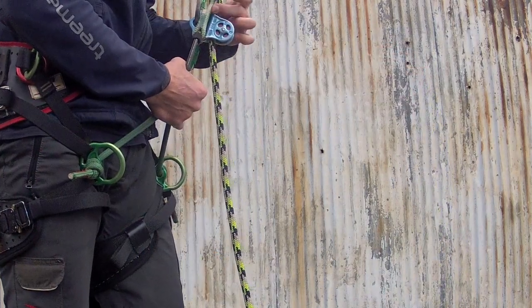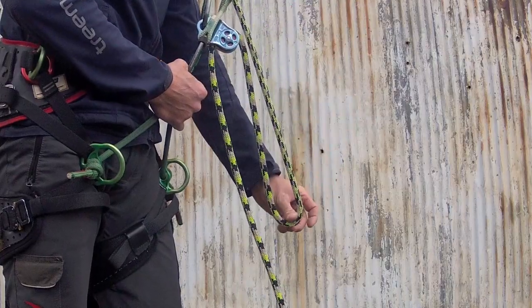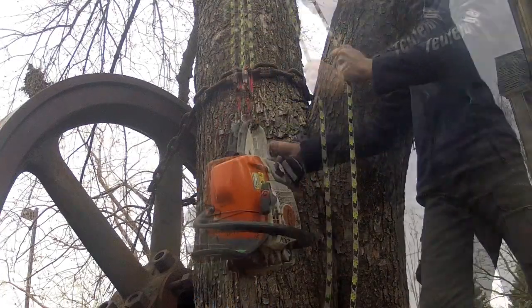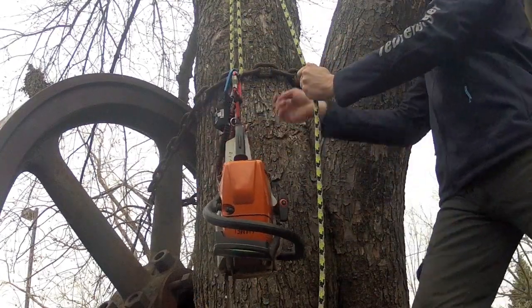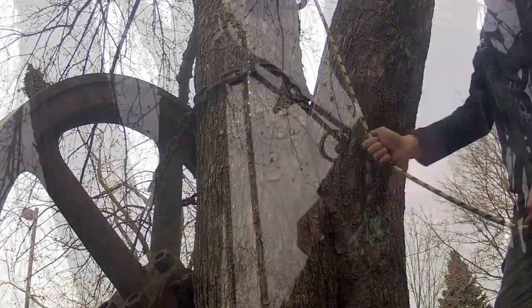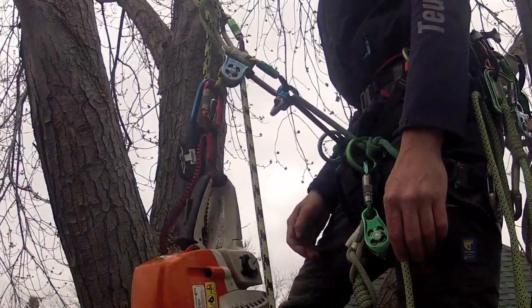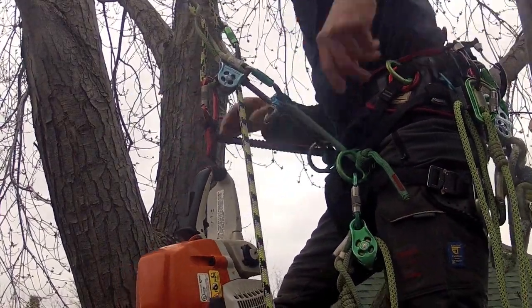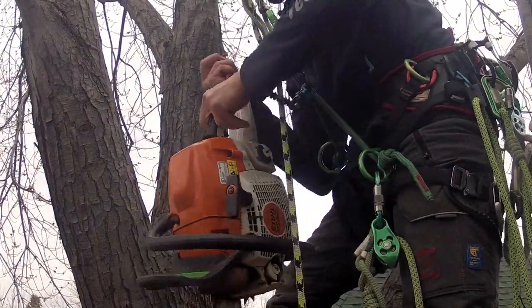For hauling functions, pull a bight of rope from the top of the hitch climber. With the bight lowered to the ground, a coworker attaches both carabiners into the bight and hauls the saw aloft by pulling on the tail of rope. As the saw is held in place from below, first securely attach antiSHOCK to the harness, and then stow the saw as necessary.